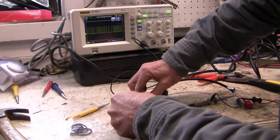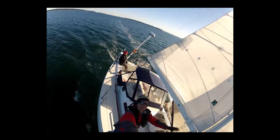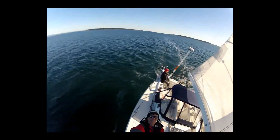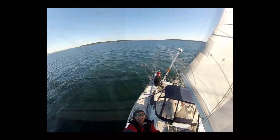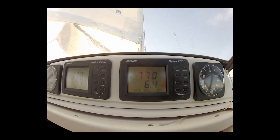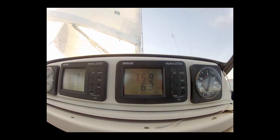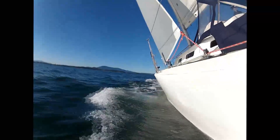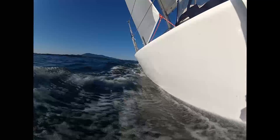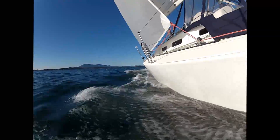I sure hope it works better in the water. Well, that effort worked. I never would have guessed the tiny amount of rust in that little spindle would have had such a marked effect, especially the way the paddle wheel seemed to spin so easily when out of the water. Here's the boat speed on display — at the upper right is the paddle wheel water speed and below that is GPS speed. In a sailboat we use the difference between the two to help decide what tide and current are doing. I did a painstaking workup of the electronics and in retrospect many of those steps were not necessary, but I've left that extra detail in because it offers insight into how the whole system works together and may be of value to you.